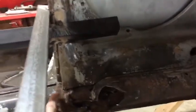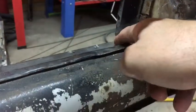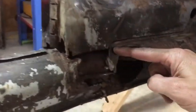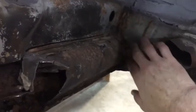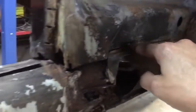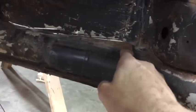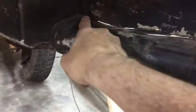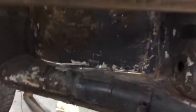I've taken my four-and-a-half inch grinder with a cutoff wheel and I've come in right here and started on the inside, right on the top of the heater channel, and worked my way all the way around, all the way back here to the end. I haven't gotten back into this particular section right here as of yet, but I've got a line cut all the way down through here. The front outside of it hasn't been cut yet. You can barely see a little bit of light through there — that's what I've gotten done so far.